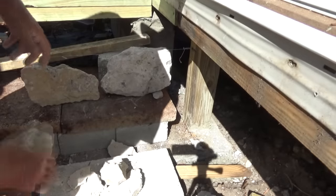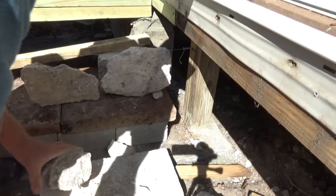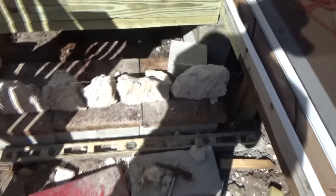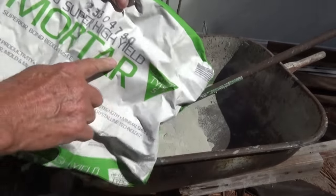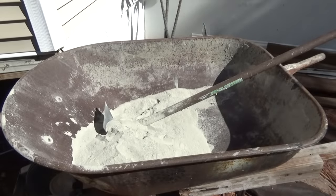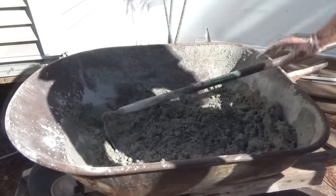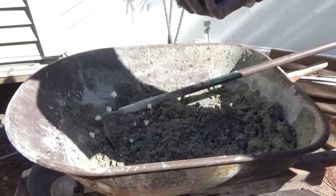I found a stone for my end piece and I want to show the joints a little different. Maybe something like that — this has got to come off, let's see if we can get that off. I can live with that, let's say that's our next stone. Keep moving it around and you find out what fits — it's one of the old school ways of doing things. Got it laid out dry to the line. Now I'm gonna mix up this mortar, pre-blended Type S with sand already in it. It's stiff like play-doh — you don't want it soft because you're gonna be laying stone on top of it.